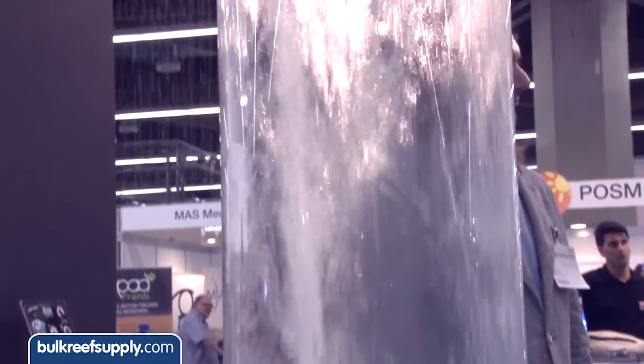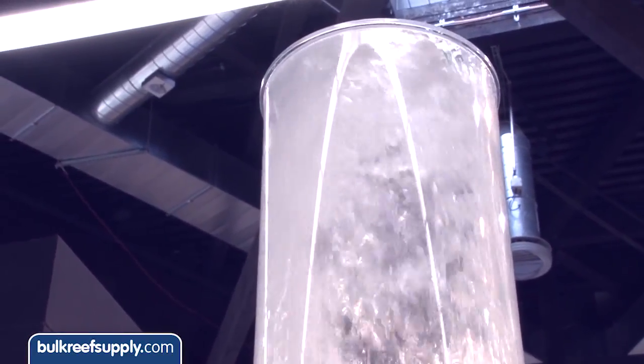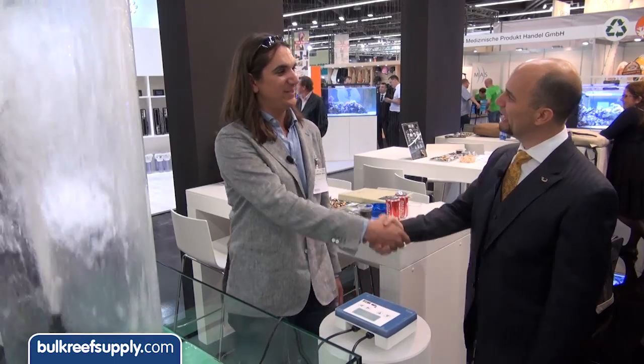So do you know how they're doing it with AC power? I do. The key to our pumps — we mentioned it on the Voyager HP — we actually have a computer chip in our pumps, so we can regulate the flow through that computer chip, and that's what forces it in the right direction. On the HF, it's a high flow pump, and again we're trying to be energy efficient. That pump brain, if you will, is what makes it more energy efficient, and we're able to lock into that and control it as far as speed. Thank you for all your time. We appreciate it. I really look forward to seeing those new pumps come out. Thank you.